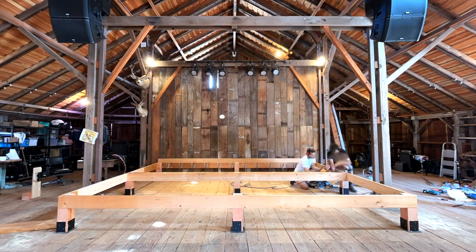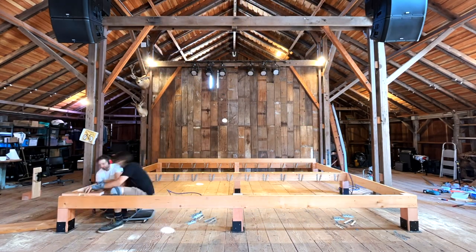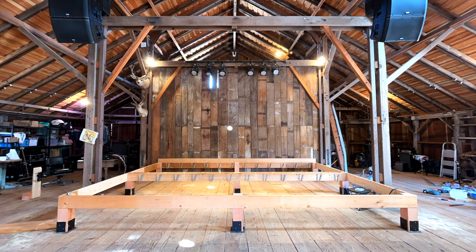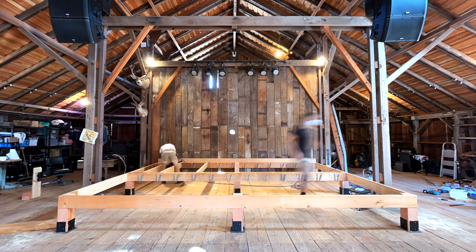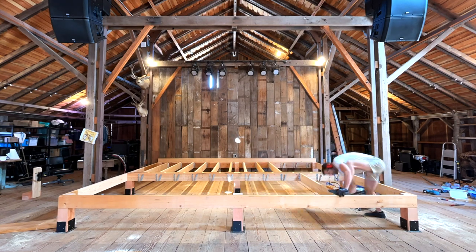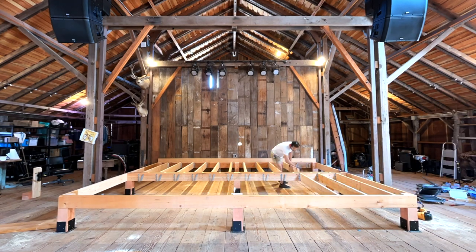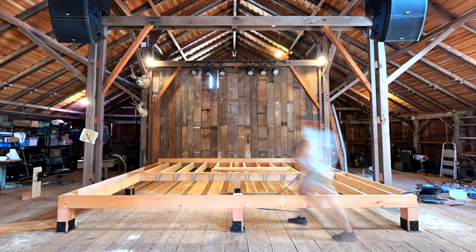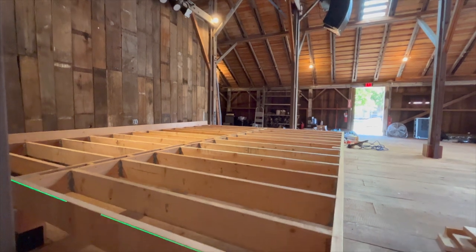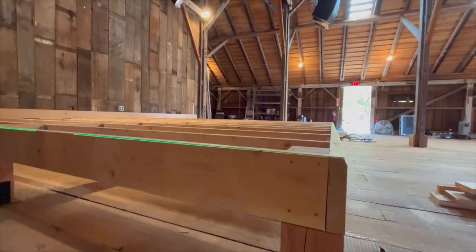Our joist spacing was 16 inches on center, and each joist spanned exactly 6 feet. We used a homemade jig and 2x8 hangers to set our joists. The resulting platform was essentially dead flat. I remember taking the handheld planer about 1/16 of an inch in one or two spots.